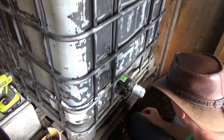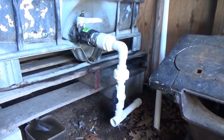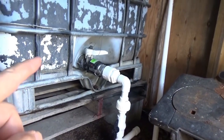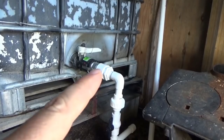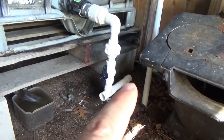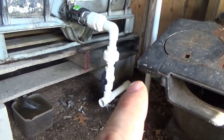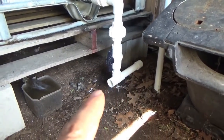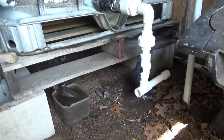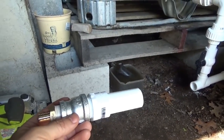Now I can measure all the PVC lines and hook this all together. Just sizing it up and piecing it together. Nothing's glued, nothing is attached yet. What I've got is the gator coupling and all my adapters, down to PVC, to an elbow to come down, to a quick disconnect coupling, to a valve, and then over to an end cap - a cut off for future expansion to go outside to some more water tanks for summer use. And I'll have a valve over here for future expansion. Then I've got a T, and from there I come over to the other water tank, up to the exact same setup over there. And on the very end, this piece comes onto the end of the other water tank.